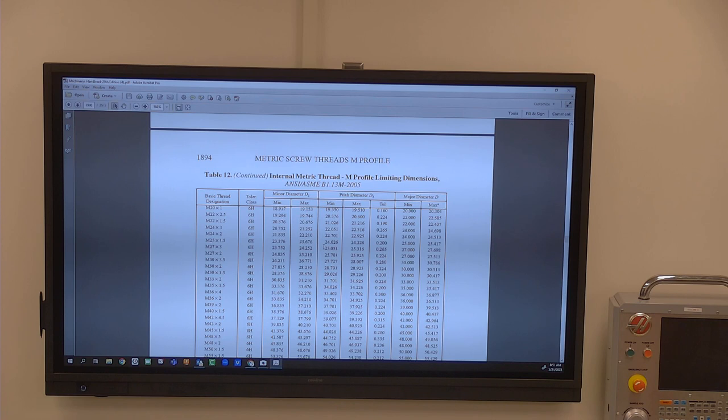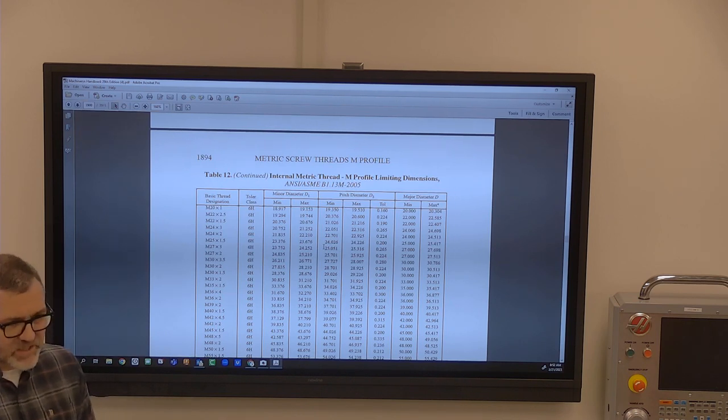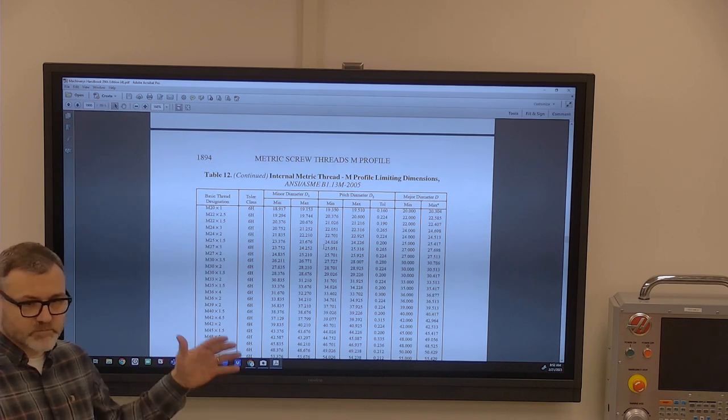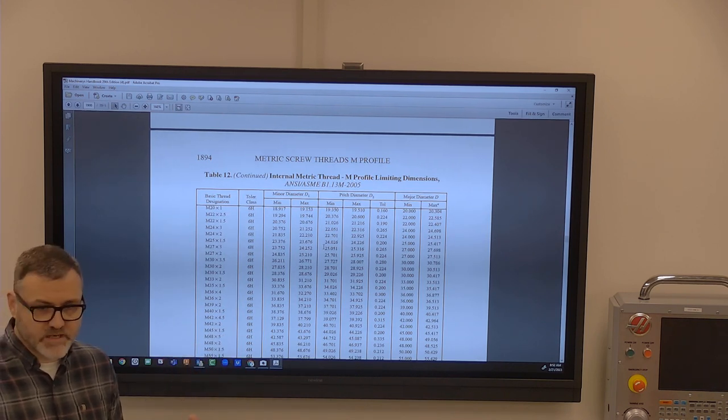So when you're done with that, I always leave my 0 to 1 rod in the micrometer. All my other ones are too long, so I don't leave any other ones in there. Whenever you put a gauge away, it's going to be really good to clean that thing off and put a little bit of gauge oil on it. We've got several tubes of gauge oil in the PMI box. If you've got fingerprints, they're known to be rusty. What's a PMI box? It's for metrology. There's a toolbox in the third classroom that's got a whole bunch of gauge oil tubes in it.